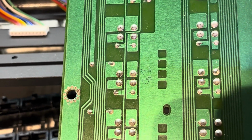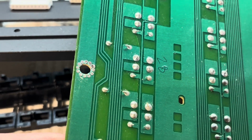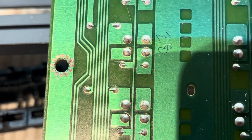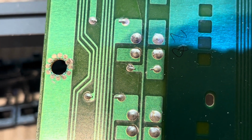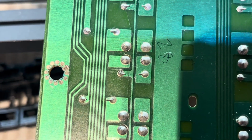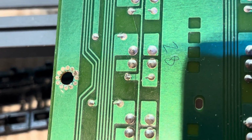And of course, like a lot of these things, once you know it's there, then you can actually see it. So you can see the center of the screen there, that is exactly that line, that crack line's going straight through that section. So I'll just scratch that green stuff off the protective layer there and back to the copper and dump some solder on that, and that should fix it.